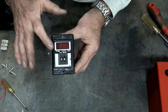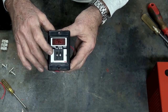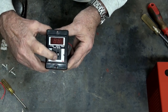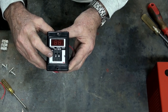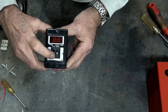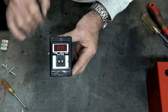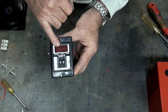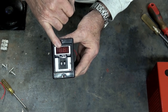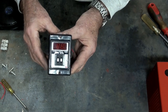The good thing about these is this one operates in 0.1 second intervals, so with the little press button switches there you can set that. That's 7.9 seconds and that's 0.9 of a second. The digital display at the top there gives you a countdown from whatever your set time is to zero. Works really well, so that's going in the top of the casing.